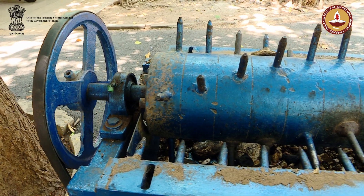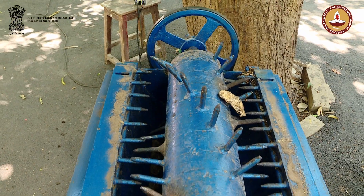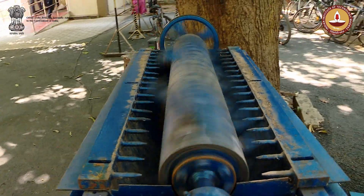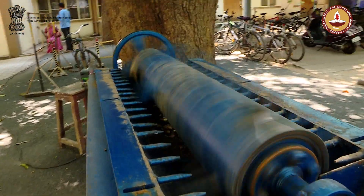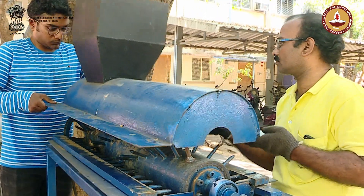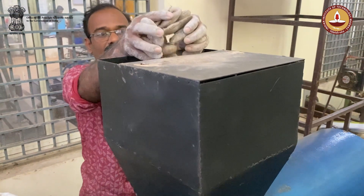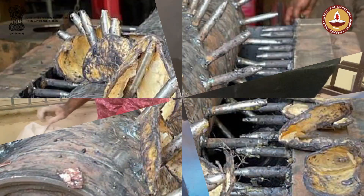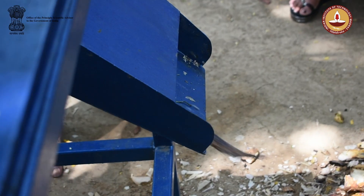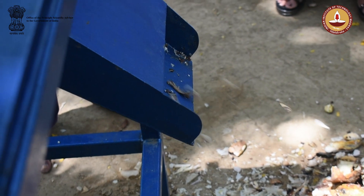This technology consists of a rotor with rows of steel pegs attached around the periphery. There are also two rows of fixed pegs attached to the stand. The rotating pegs pass in between the fixed pegs and cause a shearing action on the mango seeds. There is an outer cover which covers this rotor and acts as an enclosure. The mango seeds are dropped through a hopper, fall on the rotor with rotating pegs, and the shell is sheared off between the pegs. The mango seeds after decortication are proposed to fall through a separator, which separates the shell and the kernel.